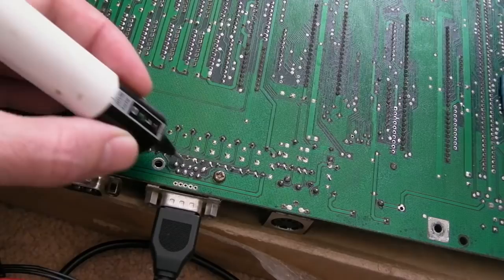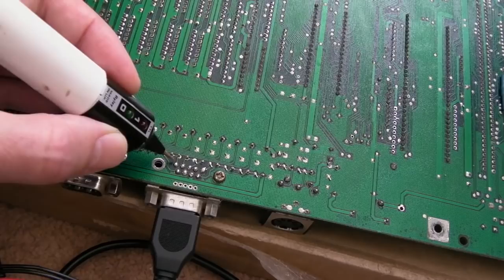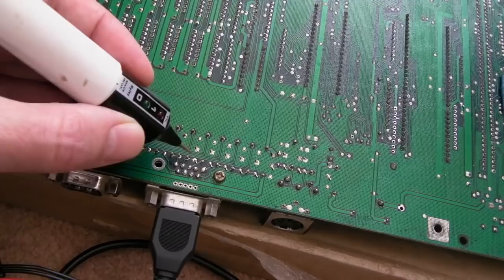So the direction's there. It's just this one over here, isn't it? Is it that one? Yeah, right. So right is not working. I'm going to make a note of which pin it is and indicate that right is not working. But what we can do is if you follow here, there's going to be a pull-up and stuff here somewhere for that. And obviously the trace to that is the thing that's missing.